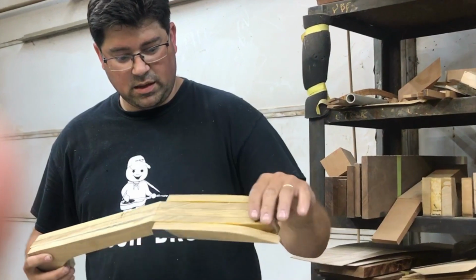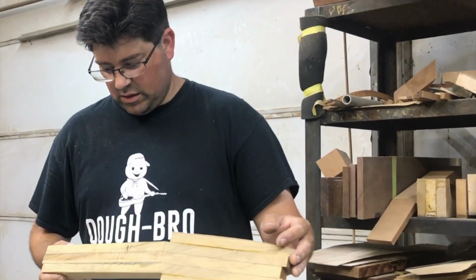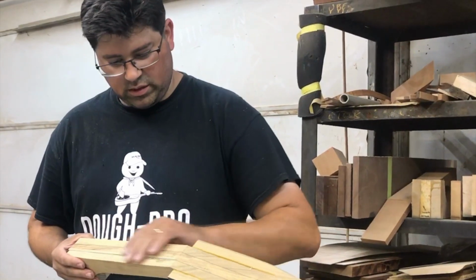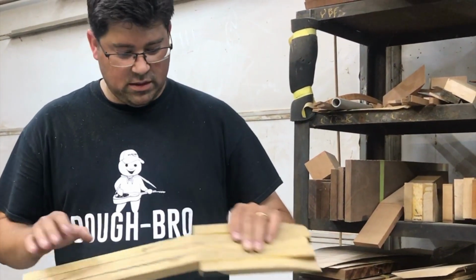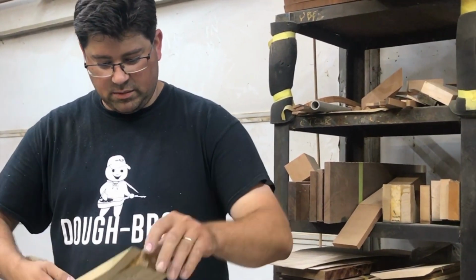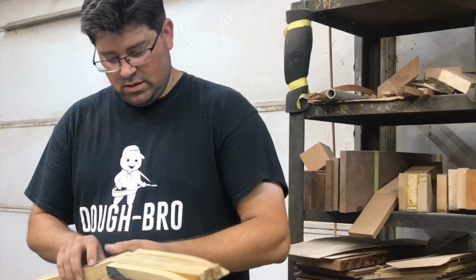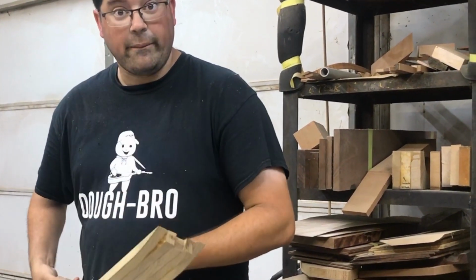So I want to clean this thing up a little bit. I'm in my other shop, got my bigger table saw. I'll run this through the table saw to flatten this out, and then there'll have to be some blocking to get it completely level. Square up the end, then I'll get the big grinder and flatten the top and thickness the whole thing a little bit so that we're about 5/8 thick. Well, maybe a little less because we got a veneer to go on the top. So that's what I'm going to do now.